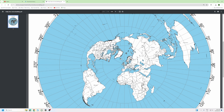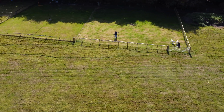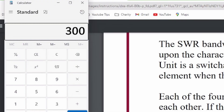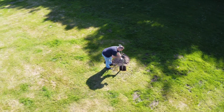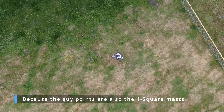I'm into a 7.45-meter radius for the guys because the instruction manual says the distance between the sides of the four-square needs to be exactly a quarter-wavelength. My target frequency is 7.175 MHz — a quarter wavelength is 10.45 meters — and after some Pythagoras calculations we end up with sides of 10.45 meters and a radius from center to one of the points of 7.39 meters.